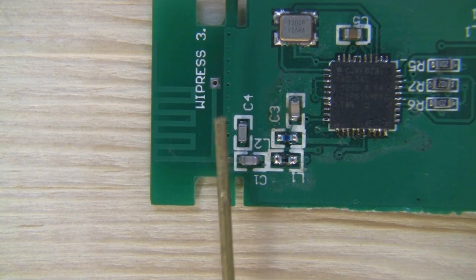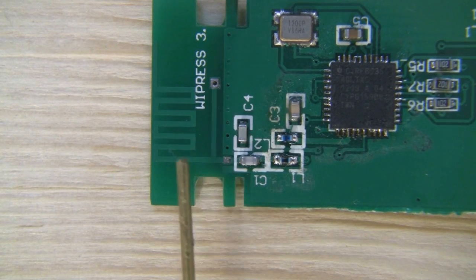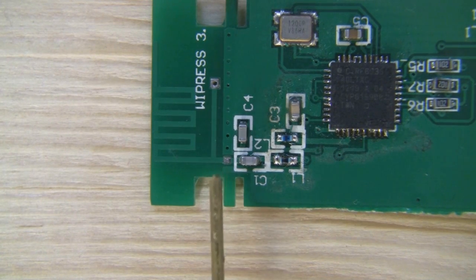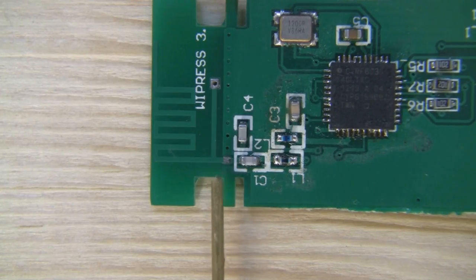So then we can add our coax and external antenna without removing any components at all. All I'm doing is severing these tracks and soldering directly at these two points. It's so small I'm not going to be able to do this on camera, but I'll get the macro lens out when I finish so you can see exactly what I've done.